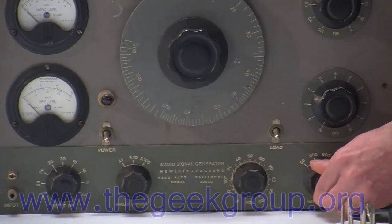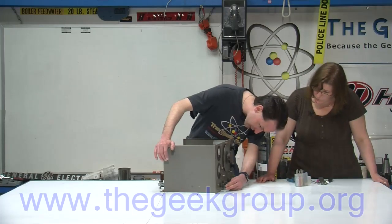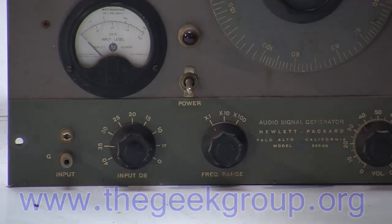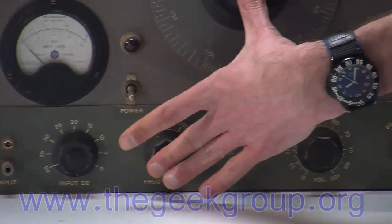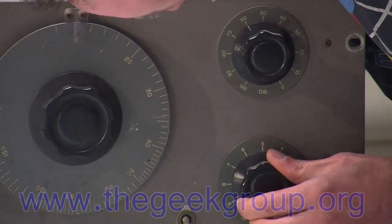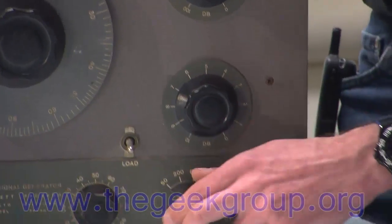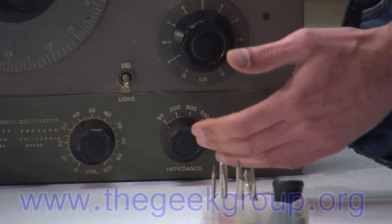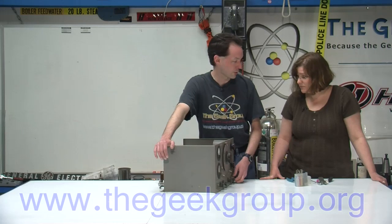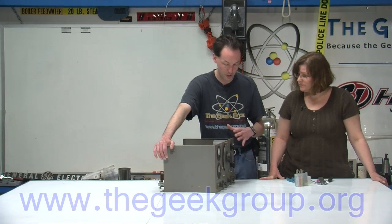This is switching the load in and out. This is your output side. Down here is your input decibels, and you can put an input on here. Without it, it just makes a sine wave. And then this sets your frequency — this is coarse adjust, this is fine adjust. These two set how loud it goes out. This is decibels in hundreds, and this is decibels in tens. This is your output impedance — it's an electronics term for matching the load. We'll do a whole video on impedance matching, but that's pretty much outside the scope of this one.